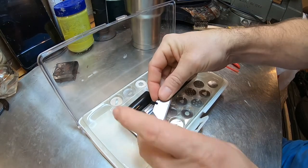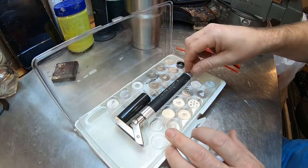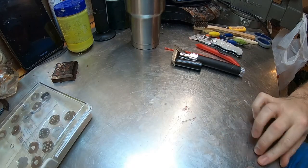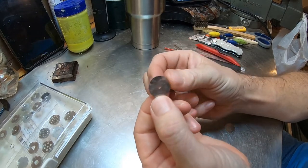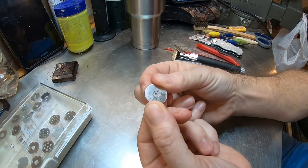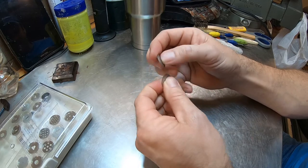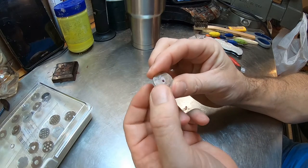I already cheated — you can see I've already got these three already dirty. I told you I had already done this video once before. Here's the trick in order to make this thing work: you find the die that you want — this is the die I'd like to make pieces of — then I find another die that's larger, so when I go over the top of it I won't interfere with the two. And I even take a third one just because I'm a belt-and-suspenders kind of guy. Park it over the top, and now we have a nice clean exit hole for our wax.